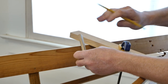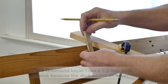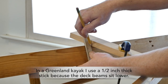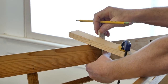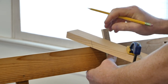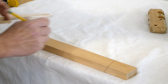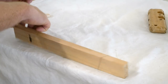This block is about 5/16 inch thick. I'm going to lay it against the gunnel and mark to the inside of the block, so there's about 5/16 inch of space between the line that would be carried up off the gunnel and the actual line I'm making. The next thing I'm going to do is connect those lines across the top and across the bottom.